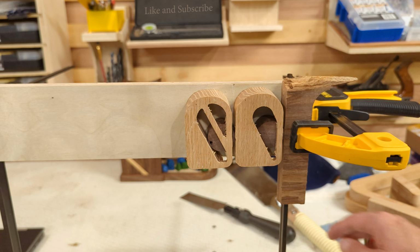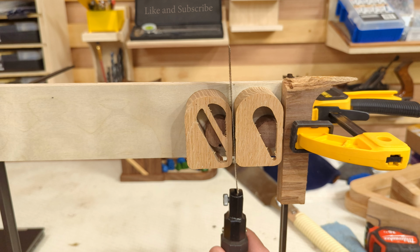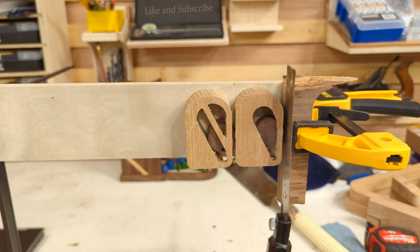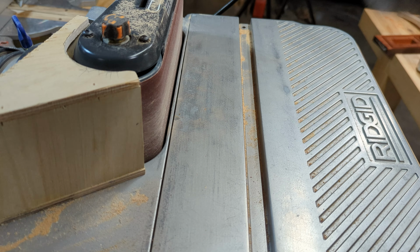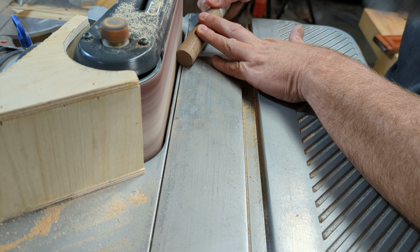One thing I noticed on my prototype was that the friction fit relies heavily on the teeth of the saw. Even though it's unlikely it would damage the set on the teeth, these saws are fairly precise, and I thought it would be a good way to improve on the original design. This caused me to rethink it and allow for a 1/4 inch recess on the back where it attaches to the base. The first thing I did was bevel the end of a few dowels for the test.